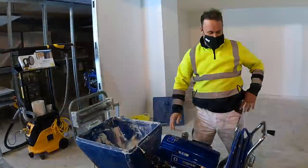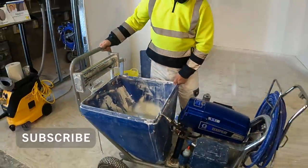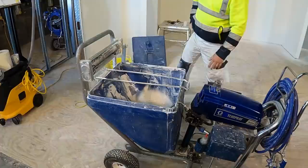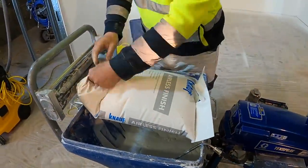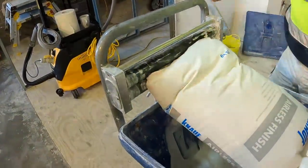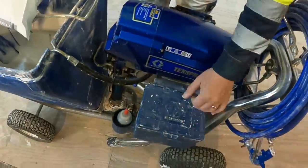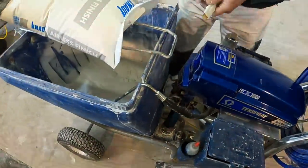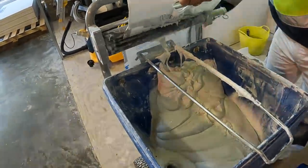Here's the machine — here's our man Chris. Can you talk us through it? So this is the Graco Mark 5 machine — this is the hopper, and this hopper will carry about five to six bags of material. What we're going to do now is load the hopper to show you how easy it is. We always load the bag a certain way — we use the handle end, and the valve end goes into the mangle. There's dry material in the valve end and you don't want to cut it the other way around. The new bags will have a dotted line across on the next production. So I'm just going to put a small cut in there — instead of me mixing, this is all I'm doing now. It's a game changer — that's it.